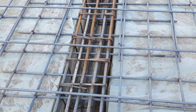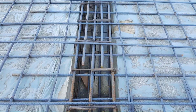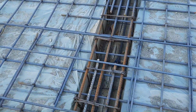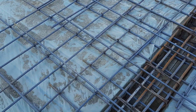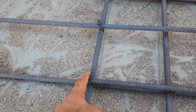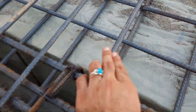You can see a lot of points of contra-flexure here. At this place you need L/4, but they did the lapping at maximum distance. Look here, there is another lapping starting here and running through the top of the beam.